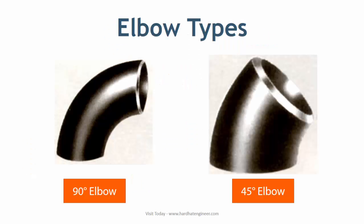What is pipe fitting? In oil and gas piping, pipe fittings are piping components which help in changing the direction of flow — such as elbow and T — changing the size of the pipe — such as reducer and reducing T — connecting two components together such as coupling, and stopping the flow such as caps.